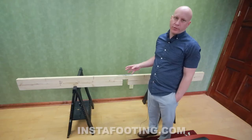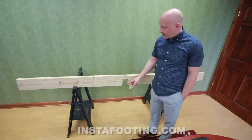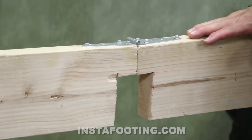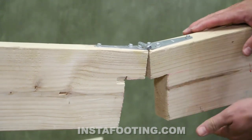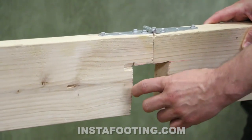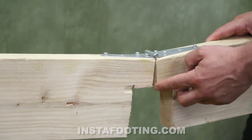Now I want to explain the behavior of a floor joist when it's loaded. I have a floor joist here that has a notch and has also been cut straight through — it's hinged on top. As you apply a load, you develop tension in the bottom of the wood and compression at the top. If you cut out a notch, there's no material left to absorb that tension, and it will eventually split open and fail.